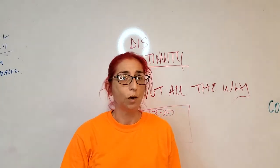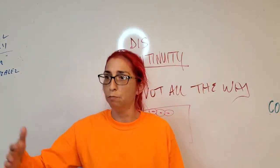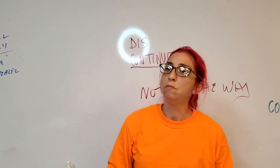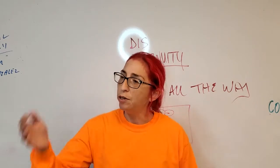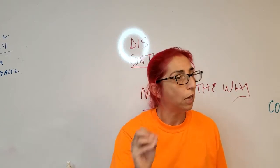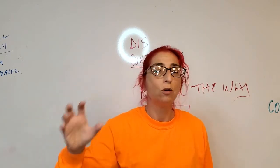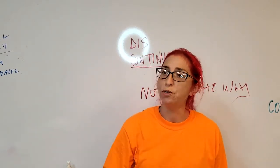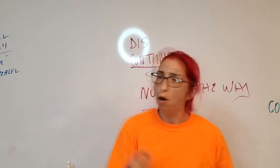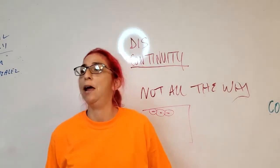Now, it also means that if we're running it too hot or not letting it cool down enough when we have a multi-bead pass, we can be eating into it. It's just too hot for it. So we need to make sure that we stay on our toes. Every time we go, especially in vertical, we want to hold, hold, hold, hold. This allows us to stop for a moment, let the material fill up, and then keep on going. Usually this will happen when you have a fast travel speed, incorrect amperage, incorrect manipulation, and incorrect angle. All of those things that make a good weld, well, you snowball them, you do them all wrong, something's gonna happen. Usually it's undercut.